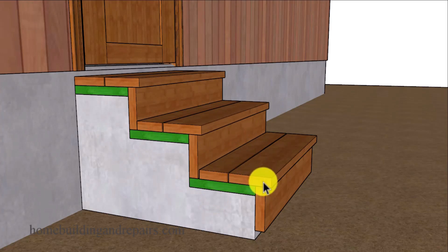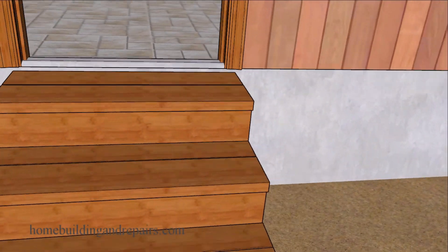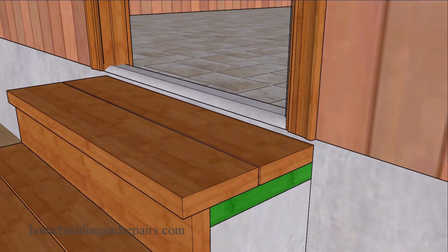The first thing on the list will be: by adding materials to the top of the concrete stairs — like we did here where we have an inch-and-a-half thick piece of wood and then another inch-and-a-half thick piece of decking — you're usually going to end up with a larger height for the riser at the bottom. And at the top you could have a problem if you just don't have enough room, or a situation where the step on the outside would be a little higher than the floor on the inside.